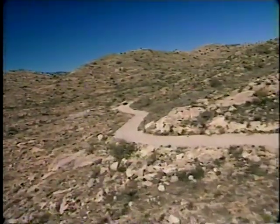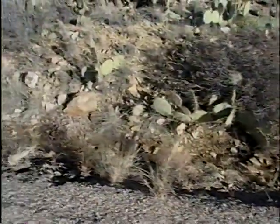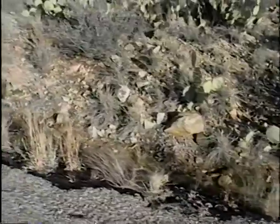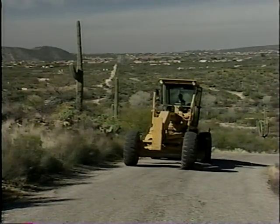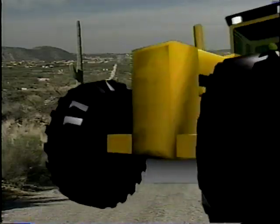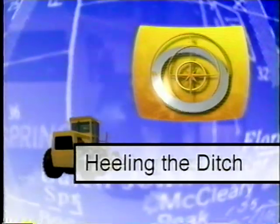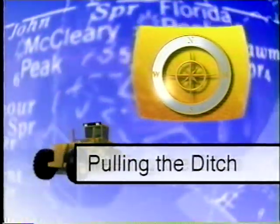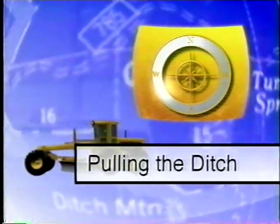By facilitating proper water drainage and decreasing road erosion, well-maintained roadside ditches and surface cross drains protect both the road and the environment. In this program, we're going to take a look at the primary methods of effectively maintaining these crucial systems. In your routine maintenance of roadside ditches with a grader, you have two primary options: you can heel the ditch, which stores waste against the cut slope until enough accumulates to warrant removal, or you can pull the ditch, removing the accumulated material and redefining the shape of the structure.